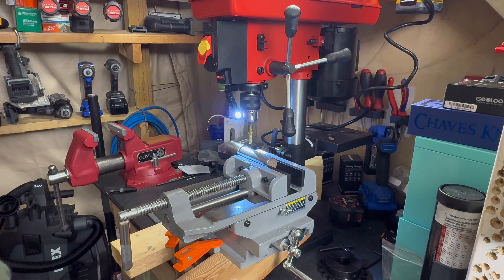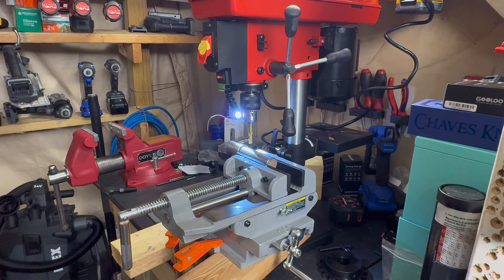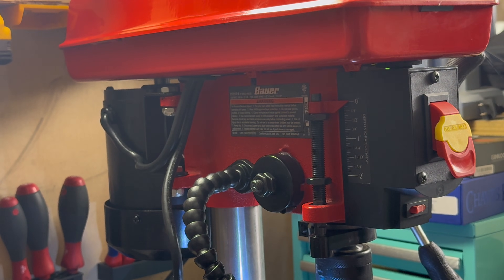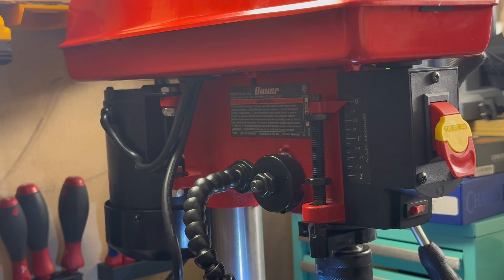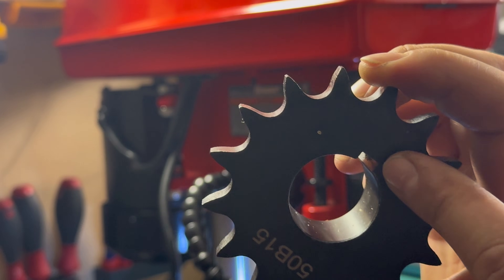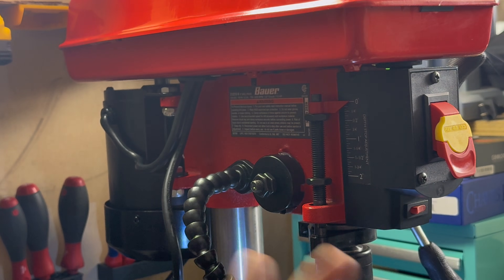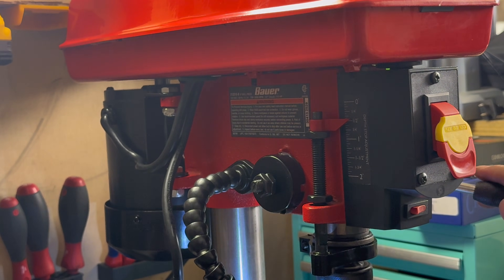Here's what I'm going to do. We're almost ready to attempt cutting this keyway. I'm about to take the end mill out — I need to go down an eighth of an inch because the key is a quarter inch thick. I measured the keyway here: it's an eighth inch deep, quarter inch wide. So we need to make the shaft an eighth inch deep and a quarter inch wide. I bottomed this out and noted that it is right at half an inch.